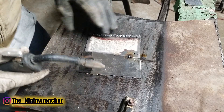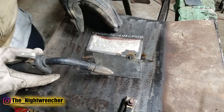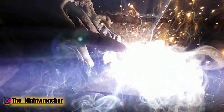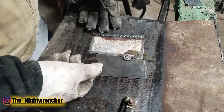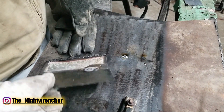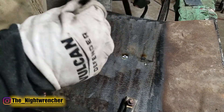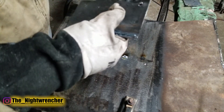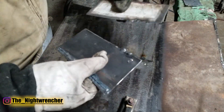Let's try this again. This time I'm going to start on one material, move it to the other one, and bring it back to see if I can get it to tie. As you guys can see, because the heat was down I was able to control it a little bit better. I've got penetration all the way through — it did not burn through this time. If I go to bend it, you can see that the weld does not break. In fact, if you keep going, the metal breaks, which means the weld is actually stronger than the metal, and that means you've welded this successfully.